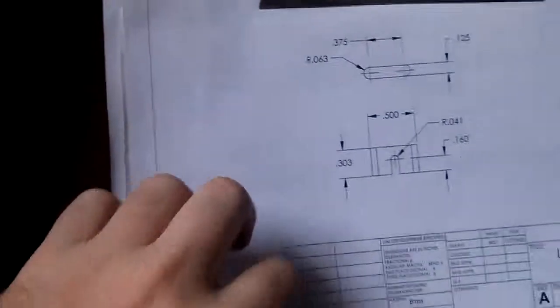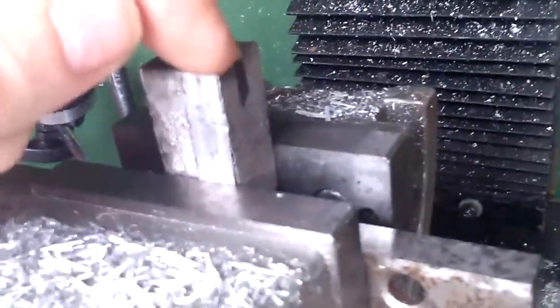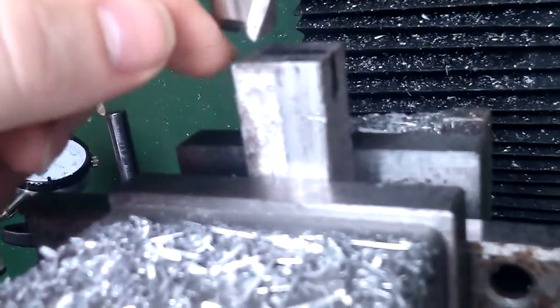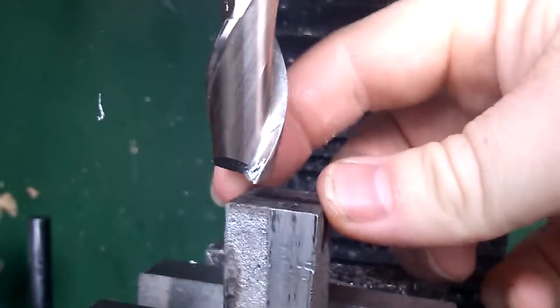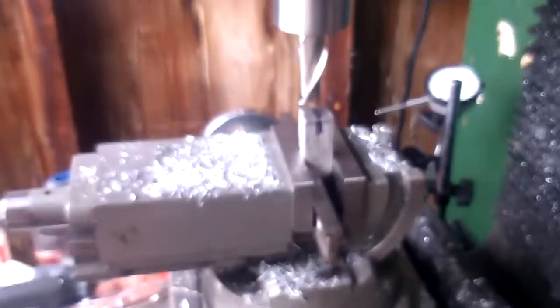This is technically kind of the last piece, although we still do have the screw. Very simple — it's just flat. You can see there I've sort of drawn where it's gonna end up, and it's got a slot in it, just right there. Simple process: I'm gonna come down, touch the top, come in a while, come over. It'll end up being about 300 thou tall, half an inch wide, and an eighth of an inch deep. Let's get started.